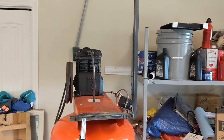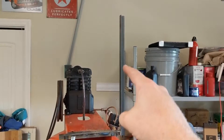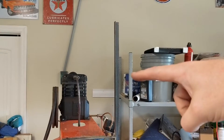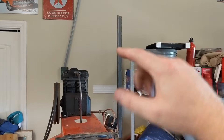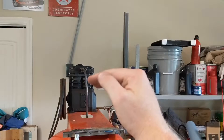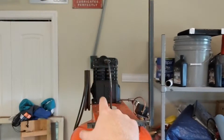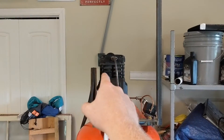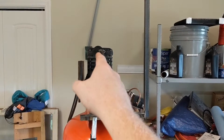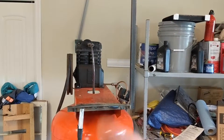This is starting to take shape. That horizontal is 12 inches, that vertical is 22 inches. My cooler is 11 inches tall, motor is eight and a half inches. I figure the cooler can overlap the top of the motor for about half an inch — it'll blow across the capacitors, no big deal. I want the air to go that way so it's going to blow into the head, hopefully cool that off, and maybe cool the incoming line off some.